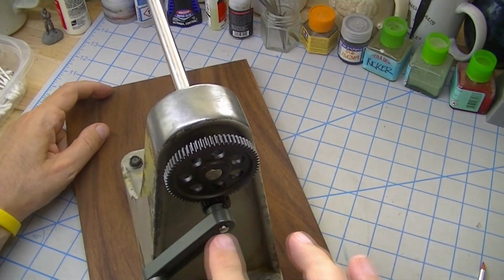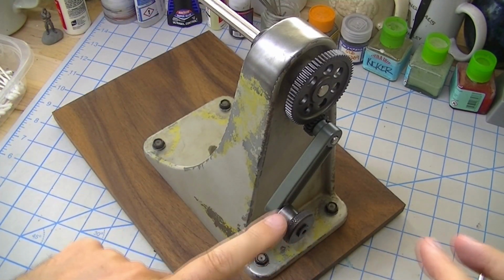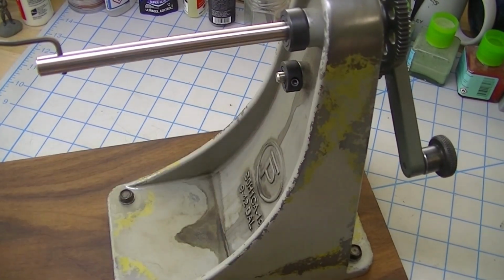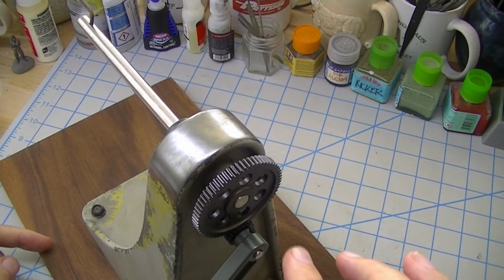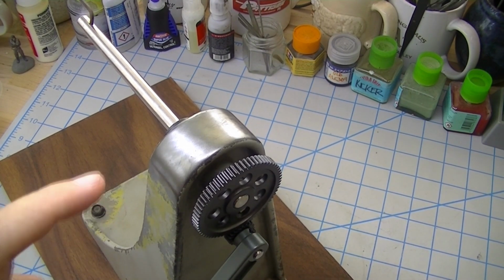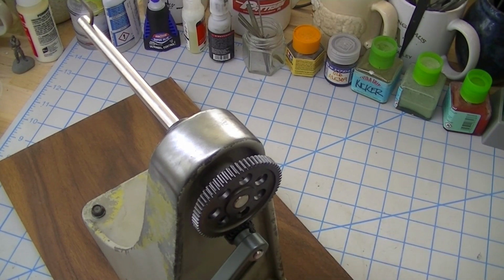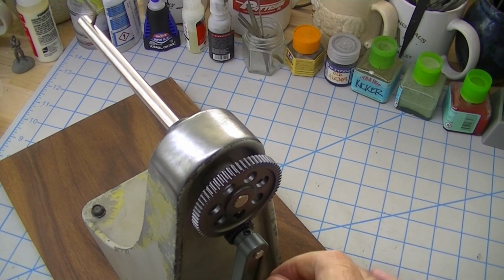The gears and the crank are 3D printed as well. The shaft, this little rotating knob gizmo, the screws, the collars for the shafts, those are all McMaster-Carr parts. So, pretty readily available hardware. The gears, there's an app that plugs into Fusion 360 that allows you to create gears by basically just specifying the diameter, the pitch, the thickness, and then it just spits out the entire gear, and voila. My mesh is a little tighter than it should be, but that actually turns out to be a good thing because I don't really want it to spin spontaneously, but it's got about a 3-to-1 ratio.